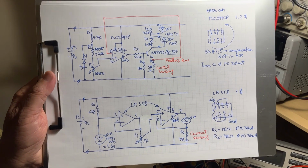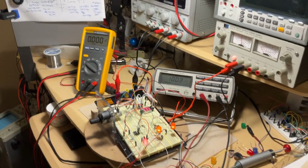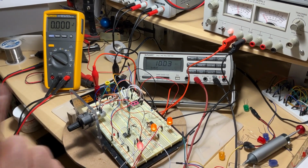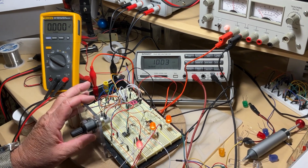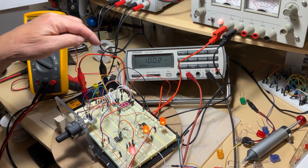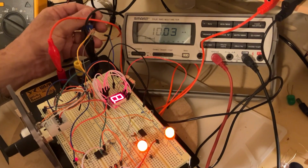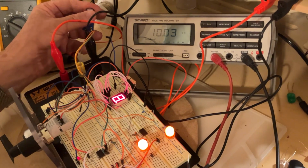So far so good? Okay, I'm gonna take this one away. We don't need it anymore. So remember, what was the purpose? The purpose was to start playing with our digits. And now we know to play with the brightness. And then we pass to the next step, which is how to adjust the brightness for this one. Actually, in a real application, you don't need to modify the brightness of this one, but you have to know how to calculate the size of the limiting resistor